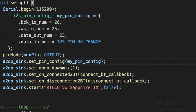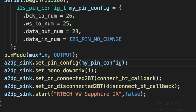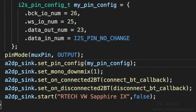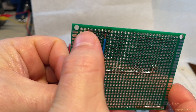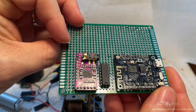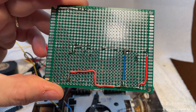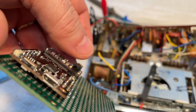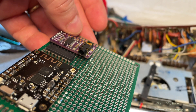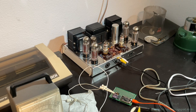Not only do I have to make hardware adjustments, but now I'll have to specify config parameters because they're no longer default. Given the track record with these companies I should have worked this out before I touched the soldering iron. Now I'm starting to install the ground bus and ground connections for the ESP32 as well as the DAC, followed by the 3.3 volts for the DAC coming off the ESP32, and then all the data lines for the DAC are installed. This is a good time to test — I can't use a headphone jack installed like this so my connection is going to be a little noisy, but power worked — very nice.